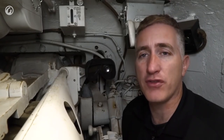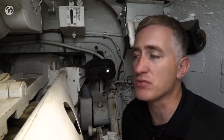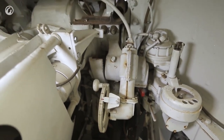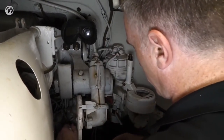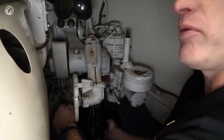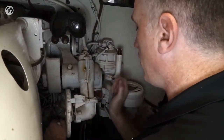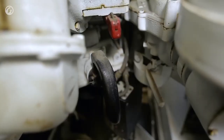That's about enough on the guns — we'll come back to that in a future Sherman episode, assuming I can find one. In the meantime, let's move on to the controls. The gunner's seat itself is actually quite comfortable. My left foot is comfortably resting on the two-foot triggers. My right foot is a little bit underneath the manual traverse, but it's protected by the skeletonized turret basket rim, so it stops my feet from getting crushed as the turret traverses. Under power traverse, a full circle would be about 24 seconds.